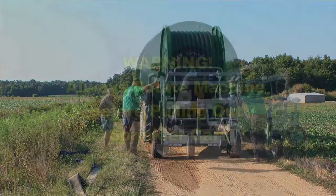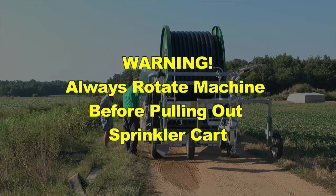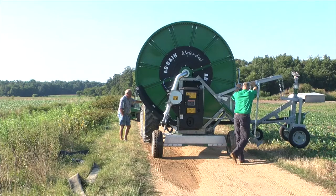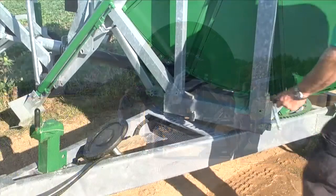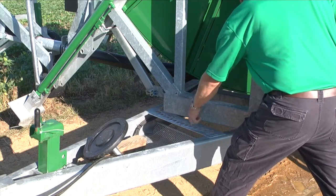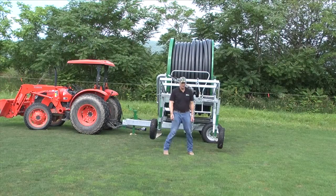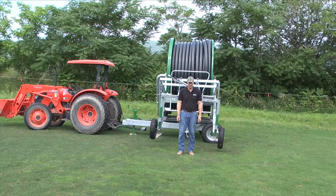Never attempt to pull the tube off the back of the machine. The sprinkler cart and tube should always be pulled out at a 90 degree angle to the chassis. The stabilizer legs will not hold a load of incoming tube if the chassis wheels are not 90 degrees from the sprinkler cart's travel path. Once you have rotated your machine, replace the turntable locking pin. Be especially careful to have the spool squarely aligned with the sprinkler cart's travel path. This will avoid unnecessary lateral stress on the level wind mechanism.